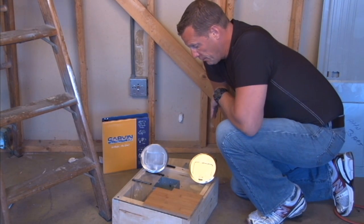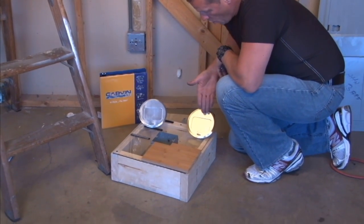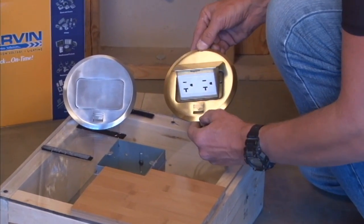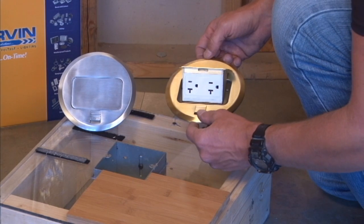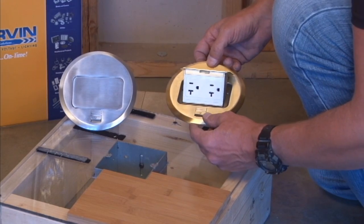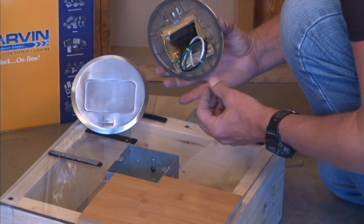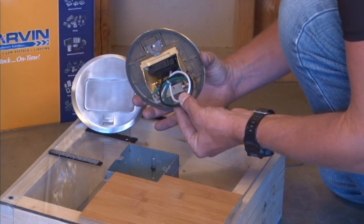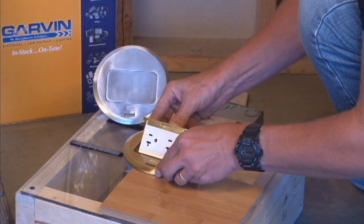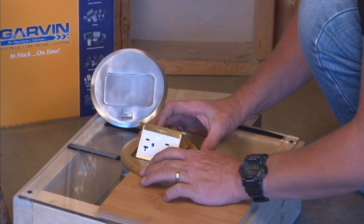After you come back for the trim, we manufacture the pop-up floor box in a stainless steel finished cover or a brass cover. It's got a retractable hasp that allows your power outlet to pop up. We make it in decorative receptacles or GFCI-protected receptacles for wet locations. It's all pre-wired in the back of the box. You simply wire up the conductors to the pigtails on the outlet, and then attach via two screw holes — here and here — the finished floor box.